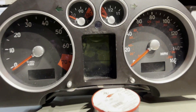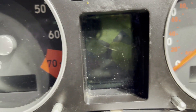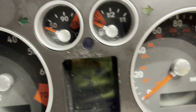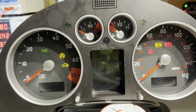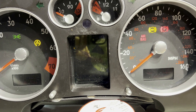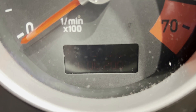This is a TT cluster that's in quite a bad state. There's actually a crack in the glass of the actual display units. This has been apart. That's reading too low. And if you power it on, it should all come to life. You can see the warning lights come up. There's no beep, no central display, no odometer and clock display. Although if you look really closely, you can just about see there — the display is actually working, but there's no backlight.